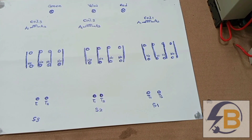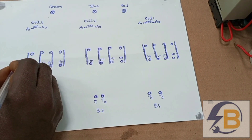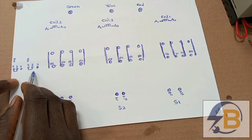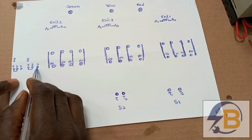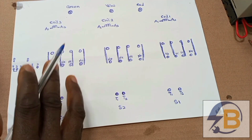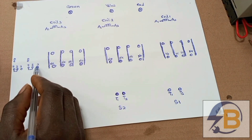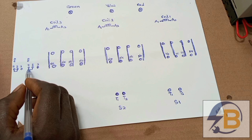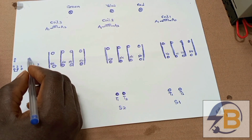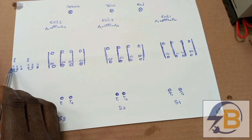Before I do that, I have to represent the timers. We have our first timer and our second timer. The terminals on the timer that I'm representing in this drawing are four: terminal 2, terminal 7 and 8, and then terminal 6, which will take the output to a coil. The same terminal arrangement applies to the second timer.